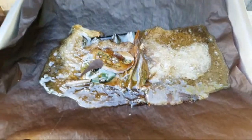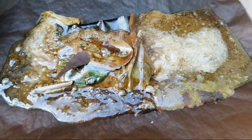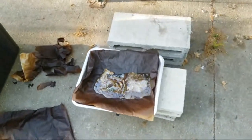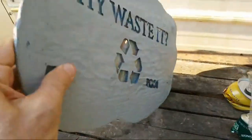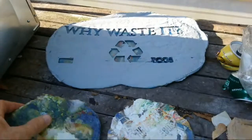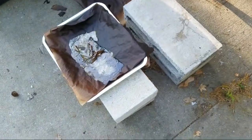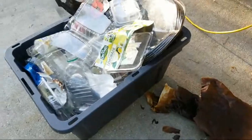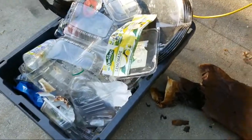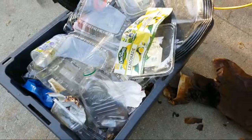That's not horrible, but for making signs it ain't gonna work, because you can tell already it's going to be really brittle. Whereas HDPE and LDPE maintain their flexibility, polystyrene will probably end up brittle as well. But LDPE and HDPE work great for making signs — we just have to make a press. This PET probably isn't worth much, and there's an awful lot of it. Professional recycling seems to be the thing to do with PET — polyethylene terephthalate.